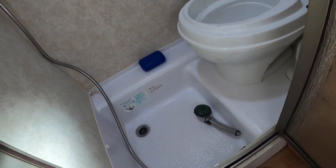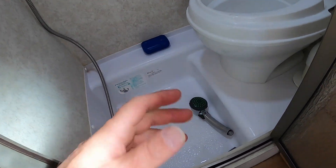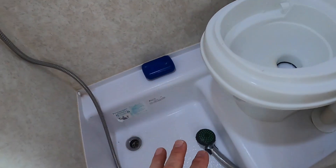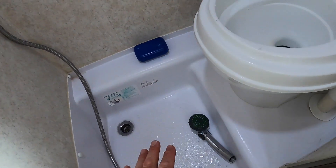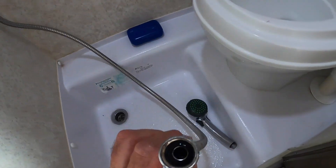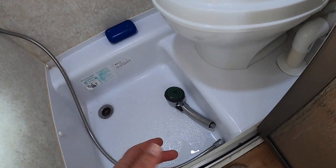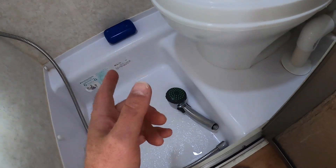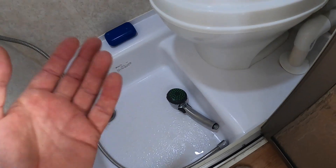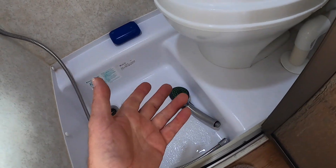This doesn't get anything that's back in my lines further in, but this will just help you make sure that you get all the water out of your lines in your shower and your sink. This is the tech tip: take off the shower heads and the sink heads before you blow your water lines out, and use a compressor that has a high volume, not just high pressure. See you next spring.